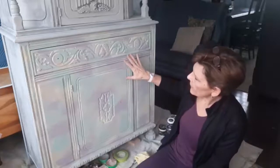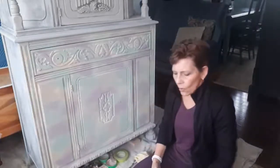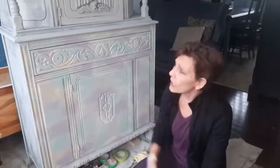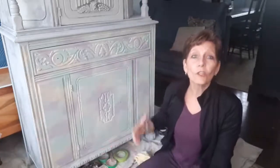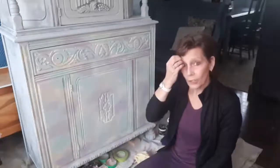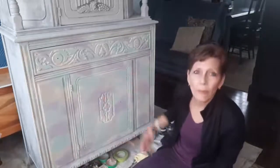So far I have added the gray wash to the rest of the cabinet except for the top — and I'll tell you why. A little tip: when you make up a color wash, you're really guesstimating how much you're going to need. If you run short and have to mix up more, getting an exact match is near on impossible unless you measure. So I usually leave the top for last — if I have to mix a little bit more, it's on the top and it's not as noticeable. Obviously that only works on a big piece where people can't see the top the same way.